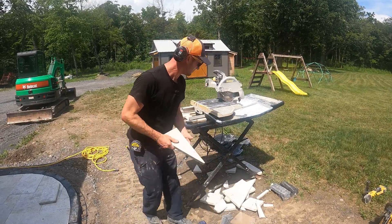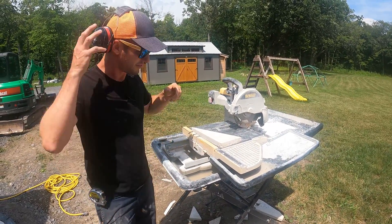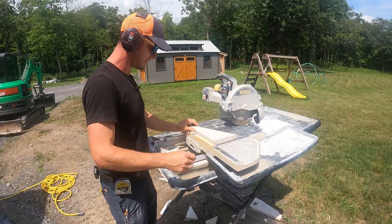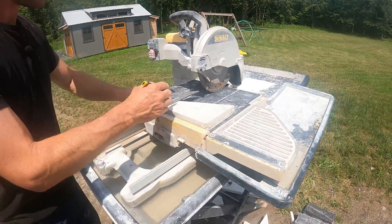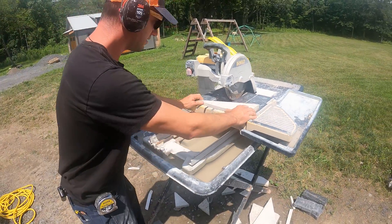The nice thing about natural stone is it'll never fade — it will change colors, but over hundreds or thousands of years. This is the wet saw. I'm going to show you how we make a cut. Say I had a line on here and I want to make a cut right there. Line it up, figure out what side I want the waste to be on, where I want the blade to be. There's a little pump that takes the water out of the reservoir. The most important thing with this saw is you want to make sure your water is at least at the mark — if it's not, the pump will be pumping air and you'll know because there'll be dust all over the place.